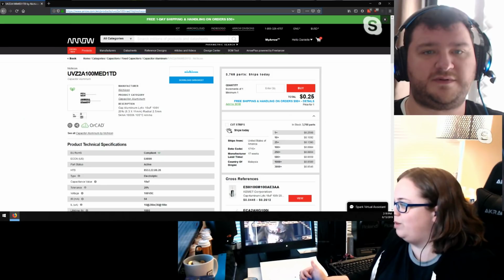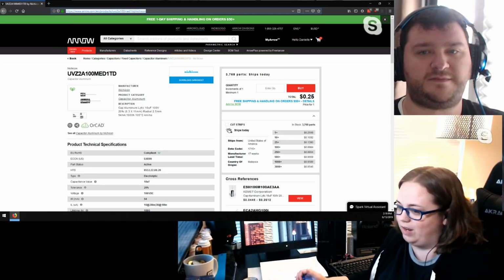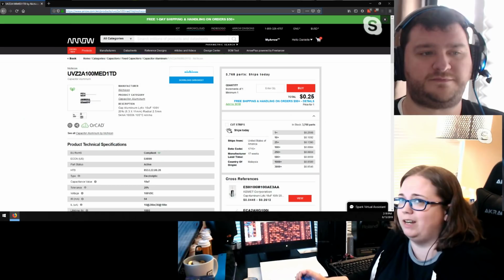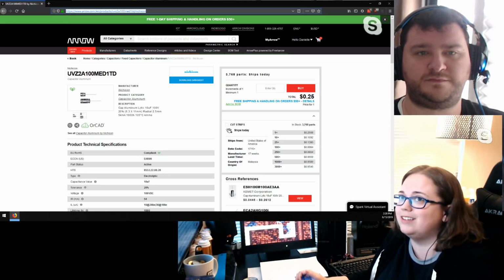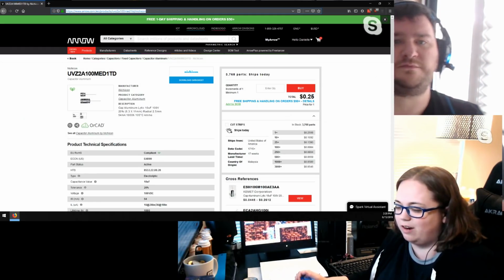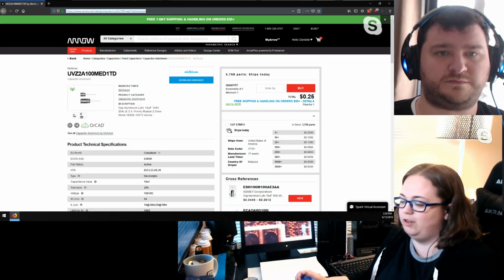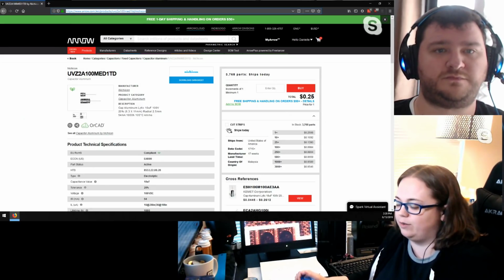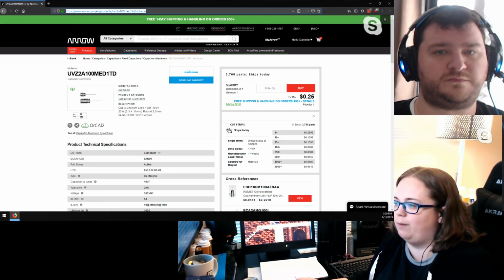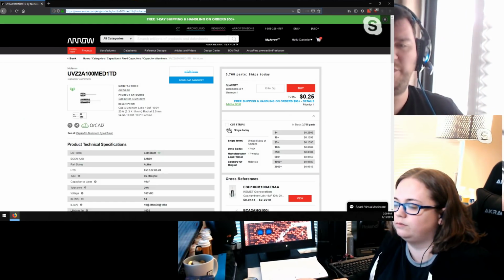So on my system, you have to have a working SRAM battery, or you have to load a floppy every time you boot. Using the floppy, you go in and set up an SXSI driver, so it works with both SASI and SCSI drives. Mm-hmm. And then you can reboot, and you create a bootloader. Once it boot loads, you can shove in your SCSI drive, set it up properly, and it works fine.